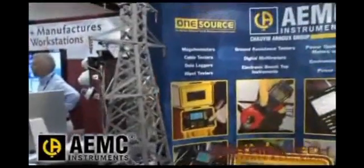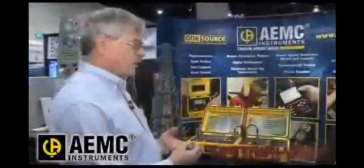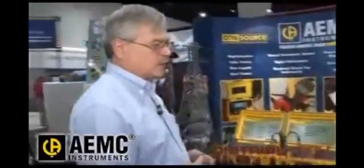It's the only one on the market today that we can effectively check the resistance of the entire tower without the need to disconnect the overhead ground conductor. So you don't need a crew with a bucket truck, you don't have to create an unsafe condition, and we can get an effective result in minutes, where it would normally take hours.